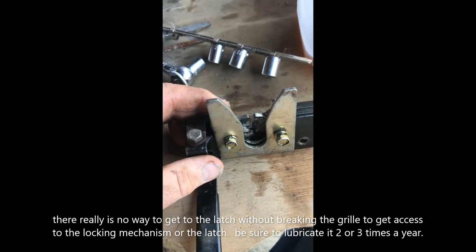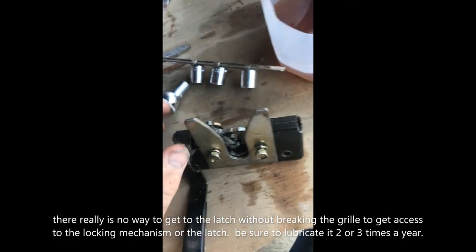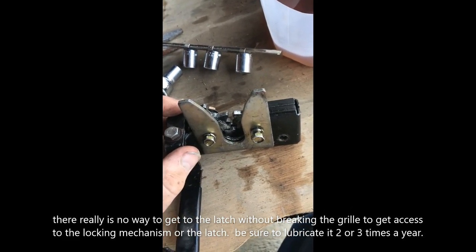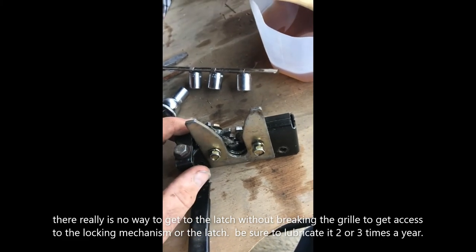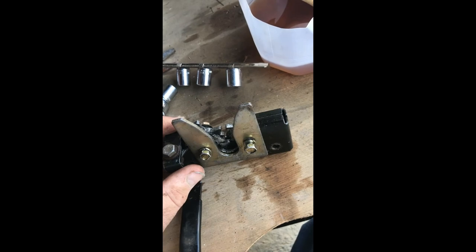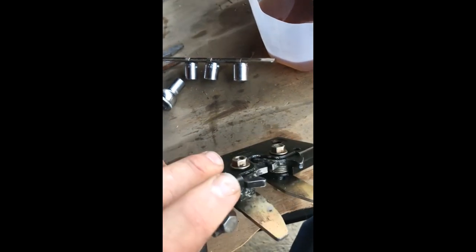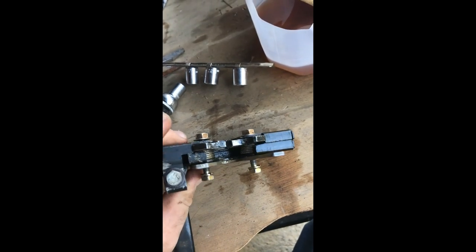It's probably not good to use lithium grease on this — that tends to gum it up when it starts to dry out. That's why I had it soaking in diesel fuel for the last half hour. I'm going to brush it down some more and put it back on. It seems to be working fine now, but probably two or three times a year you have to go in there and spray it with WD-40 or whatever kind of very thin lubrication you want, just to keep it working smoothly. All right, talk to you later. Bye.